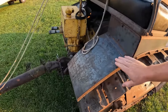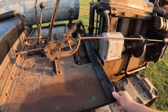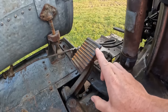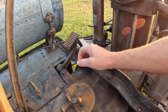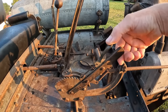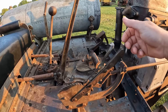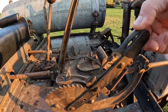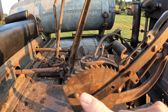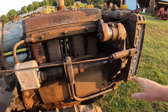The more we look at it the more interesting it is. All the fenders — look how clean that is. Seat box clean, even the front edge is clean. See how sharp the serrations are on that brake pedal yet — just a little bit of wear on this edge, this one same way. It's got the early-style throttle on it yet, because we've got this little brass detent lever right here. The later ones went to just more of a flat piece of steel. We've got a brass lever, a little pull rod down to the pivot, return spring on the other side. Look at how sharp all of the quadrant teeth are yet.